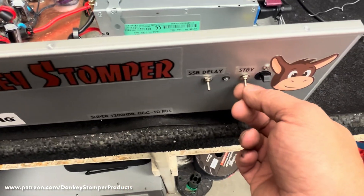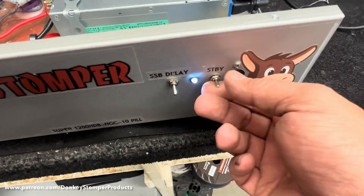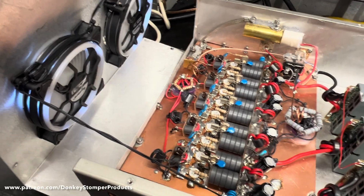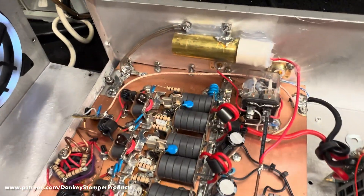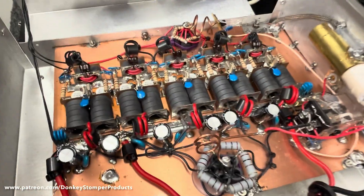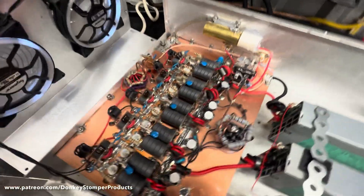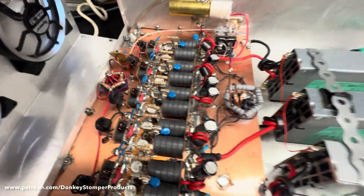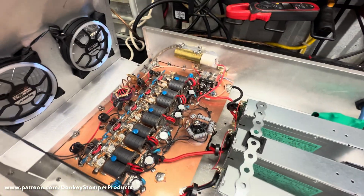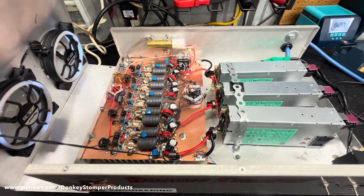When it gets so hot it'll kick off - it won't key anymore. All you have to do is quit keying, wait to cool down - the fans still run. When the light comes on, it's just in thermal mode. That'll help protect your transistors. Like I said, you know who you are - I don't like calling names. I've talked to you for years on Skip and I think a lot of you, so we fixed you up man. That's why I got the HPs - saving some money.